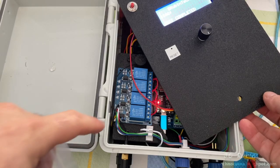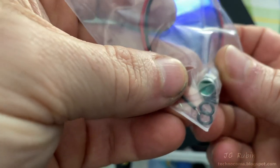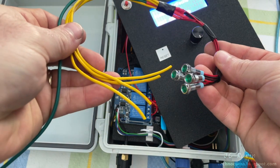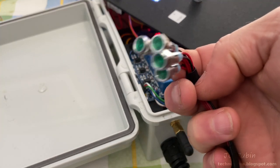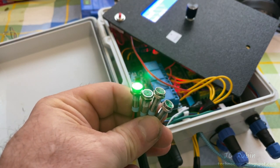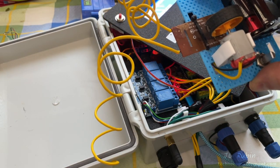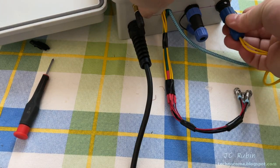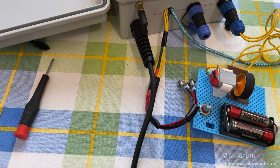With all the new components and changes we now have our latest wiring diagram. I've plugged in the firmware connectivity USB cable and, since I only have one solenoid, I'm using industrial lamps rated for 30 volts AC as indicators in place of the solenoids — they're a nice bright green color. I also added more flexible cables onto my water meter emulator and wired it into its plug, making it modular so we can connect it right up. The interrupts for the water meter still output to serial for testing purposes.